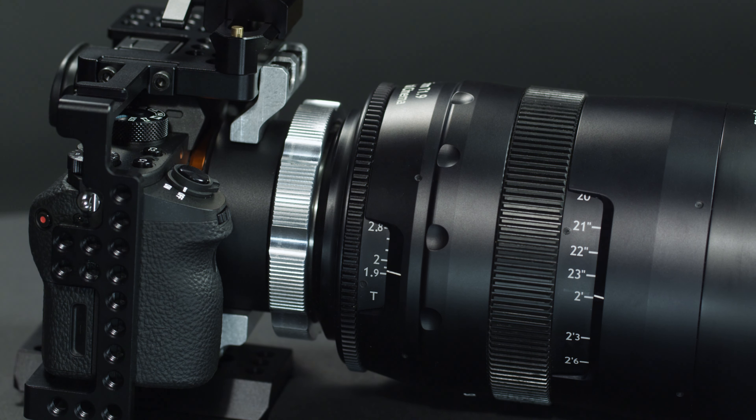Let's look at the bottom. You see the flatted slot in the barrel here. It's important to loosen the camera screw so the camera has plenty of play during assembly. Then attach the bottom bracket first to the barrel with the M3 screws. Make sure it's aligned square to the barrel — I like to pull it up so that it's touching the edge of the slot. Keep everything nice and loose so you can get these last two screws in, then when everything is aligned, tighten down the two screws to the bottom of the cage, then the two into the adapter barrel.